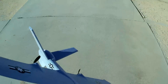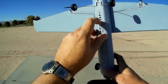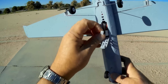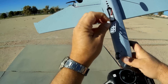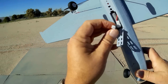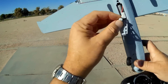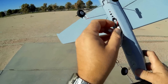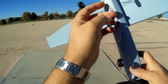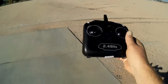Let's go over how it's powered. It's powered by a 450 milliampere hour battery — actually a common 450 milliampere hour battery. The connector is kind of an odd one. It looks like an MCPX connector, but it is not. I tried to plug it into my MCPX chargers and it just wouldn't fit — it's a little bit large. So one option you might consider, if you want to use generic batteries, is to change this connector to something like a white JST connector, and then you can use generic batteries in this.